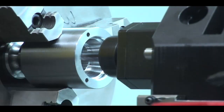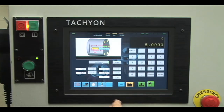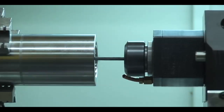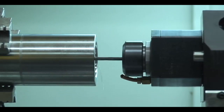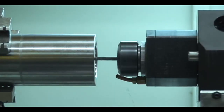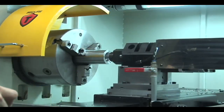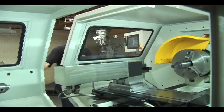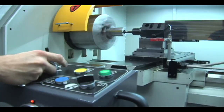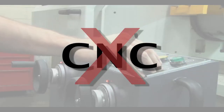Since the Xena lathe has been transformed into a conventional milling machine, the machining parameters, such as the rotation speed and cutting feed per revolution, are now transformed into angle of rotation in degrees, minutes, seconds, and cutting feed in inches per minute. This automatic conversion of the feed parameters enables the operator to work in an environment of traditional feed conditions already mastered. The operations have clearly demonstrated the machining of a complex part normally requiring CNC equipment and all the accessories related to that type of machinery.